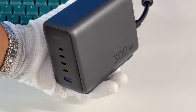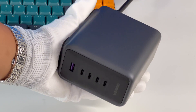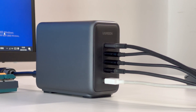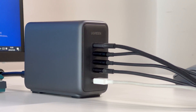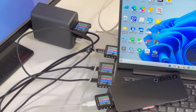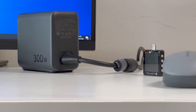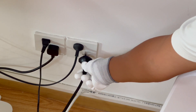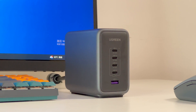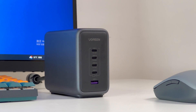That would be all the tests for this charger. What surprised us is that USB-C1 can output 140W under any circumstances. Compared to what it claims, there are both good and bad aspects. The standby power is pretty low, while the conversion efficiency is average. But the ripple is sometimes too high, and it will feel hot after long-term use. Since this is a high-powered desktop charger with a grounding pin, it is more suitable for those who want an all-in-one charging station that keeps a neat desktop. Okay, that's all for today's video — please drop a like, leave your comments, and subscribe to us. See you next time!